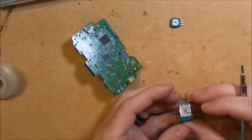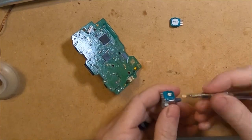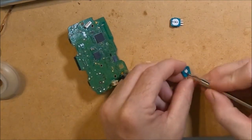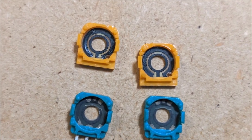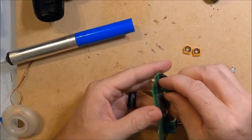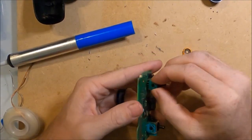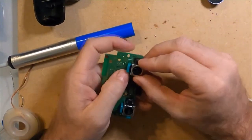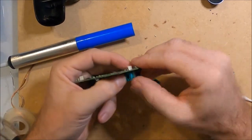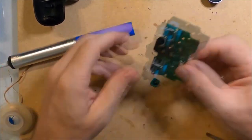I have the new thumbsticks and I am carefully removing the new potentiometers with a small knife. Comparing the original ones to the new ones I can see the difference — the old ones are orange and look completely worn out. Now I take a new potentiometer and push it into place. It takes some wiggling but eventually it will go into place. A quick test shows that everything moves freely. Do the same for the second one.